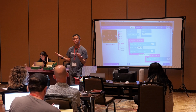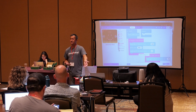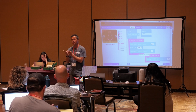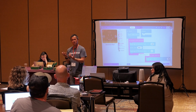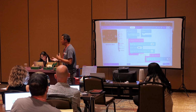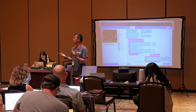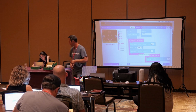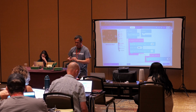Or be able to control a desk lamp with my microcontroller, I wouldn't be able to do it just as it is, because the desk lamp has the two prongs for the power, I need something to be able to send a signal to it to turn it on and off. And for that, what you would have to use is something called a relay switch. So a relay switch is something that will allow you to make something be a switch that you can turn on. So this is the thing that is the switch. So I'm going to connect one here.